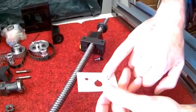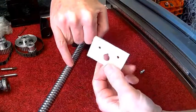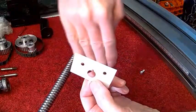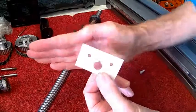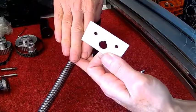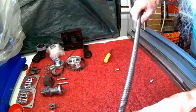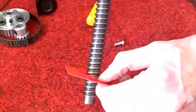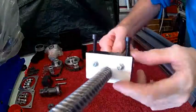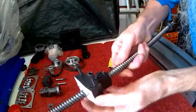Going back over to the machine — this groove needs to be wider, because when it runs on there it's sitting horizontal crosswise and it's tilted, so the width of that flat section is wider. I cut out the cover in plastic so it then twists. So far it fits in — we line it up with the start of the thread, and that lip needs to fit in there. The edges line up and so do the screw holes.